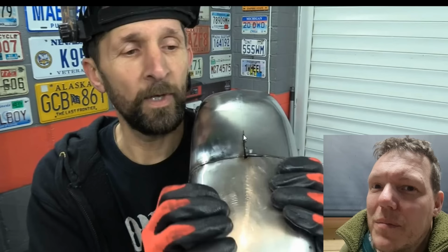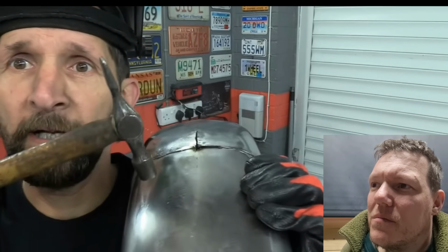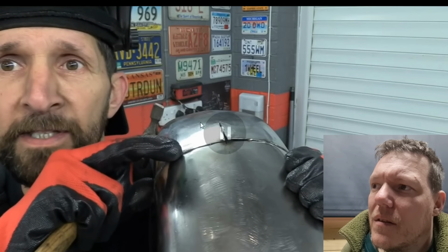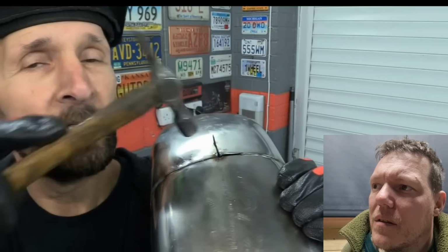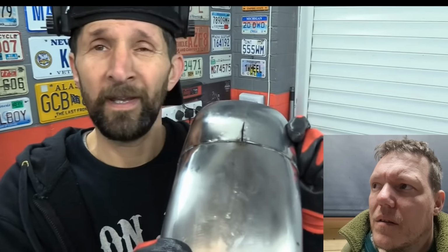Because it's not meeting up there. It doesn't match there. All I do, I've done that side, as you can see. Take your little toppy hammer, and you just tap that side down in, so that then meets it. And this one, as you can see, you just tap that down in. As this one at the back was more like this, that's exaggerating it. All I've done is cut a slit there, and when you hammer them down, the slit comes together and you just weld it up. So it's just making it up as you go along.